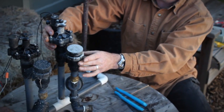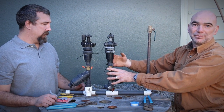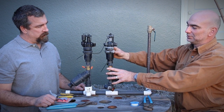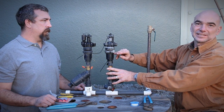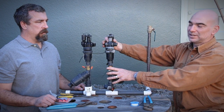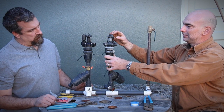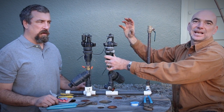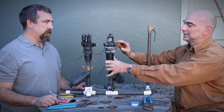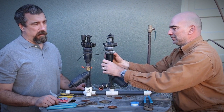So Trevor showed cleaning that out. Then if you've got old galvanized pipes, or if some plumbing work happened recently, you might find it's leaking, that slow leak Trevor was talking about, and that's the seat gasket. If that doesn't work, then you want to take the whole actuator. These valves are cool in that way. On the Irritrol 311A, you can just pop the actuator off, leave all this, and replace that. A lot of other valves, you're going to want to replace the whole thing.